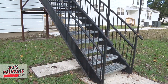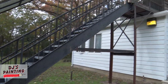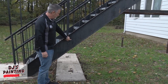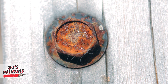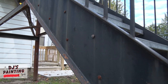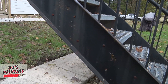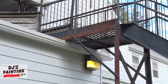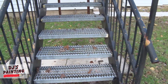These metal railings — you can see there's a lot of coats of paint on here and it's failing, there's rust coming through and they're in really bad shape. Any place you have dissimilar metals coming together — steel galvanized with different kinds of bolts, maybe plated, maybe not — dissimilar metals touching causes rust. You've got a million points where dissimilar metals are coming together on this stairway.